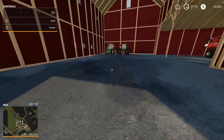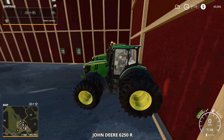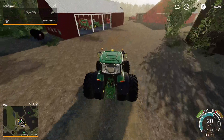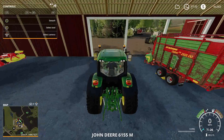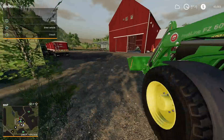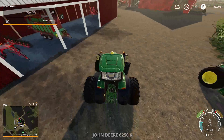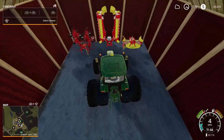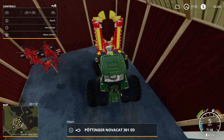We've got two mowers, and we're going to use the larger John Deere tractor with the dualies. Here's a little trick that not a lot of people know about: when you have these Pottinger mowers, the front and the rear, you can actually attach them together into one unit, put it on the front, and then tow the windrower behind you so that you don't have to make an extra trip. We just have to move this smaller John Deere tractor out of the way first. The mower that usually goes on the rear, we're going to put that on first and attach it to the front of the tractor, and then the mower that usually goes on the front, you attach it to the front of the rear mower.